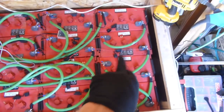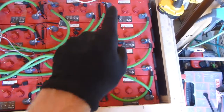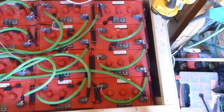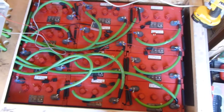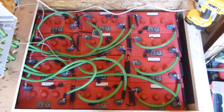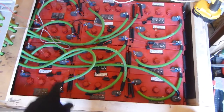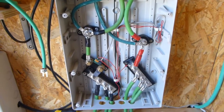I've still got some more work to do on these batteries. I'm going to switch every second one around — probably start with this one and then that one — so I can change that longer cable to one that is the same length as all the others. That should also clear up the cable mess a bit. It's messier now, but with cables all the same length there's always an excess with the batteries that are closer to the bus bar.